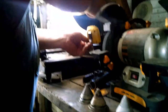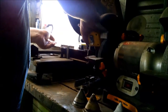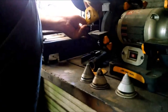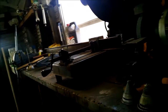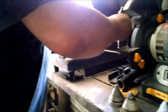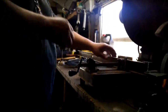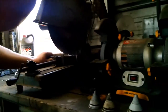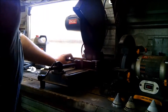a little soapstone here. And we are going to measure it. Well, provided the tape measure cooperates, we're going to measure it. Sight down the blade till we get right on the edge of that fat line. Lock the clamp down.